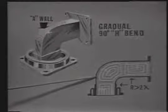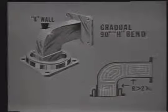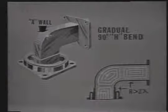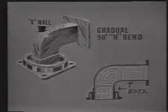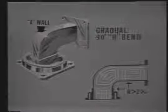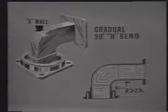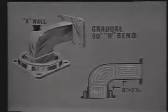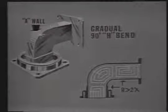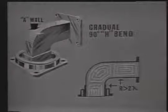Again, the radius of the bend must be greater than two complete wavelengths to minimize losses due to reflections. However, the bends must be made gradually — if they are too sharp they will cause reflections and losses. A bend may be greater or less than 90 degrees depending upon the requirements of the individual system. Also, if there are any dents in the walls of the waveguide, these will also cause reflections and losses. So when you get out into the field and start to handle a waveguide, be careful with it and try not to dent or bend it in any way.